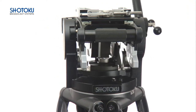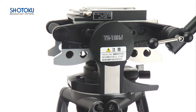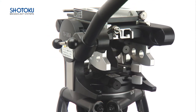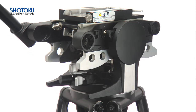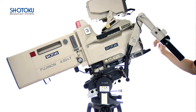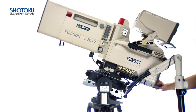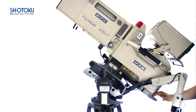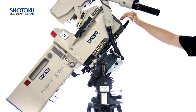The TE12 has earned a reputation as a robust workhorse of the industry thanks to its simple low maintenance design and lightweight construction, making it popular in outdoor broadcast applications such as live sports and other events where large field lenses are used. The TE12 achieves this using a unique roller and cam system which holds the kit center of gravity height constant to achieve perfect balance. This mechanism eliminates the need for complicated counterbalance springs, keeping both the weight and manufacturing cost down. The benefit of this simple system is an incredible max payload to weight ratio and high value for money performance.